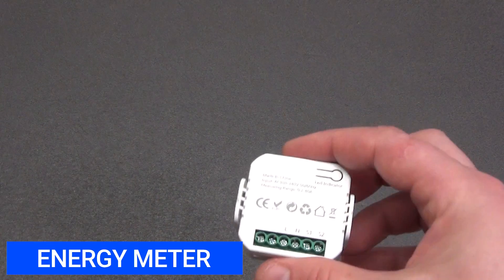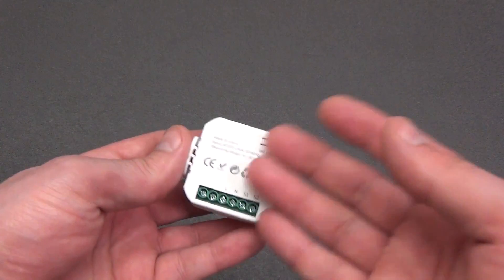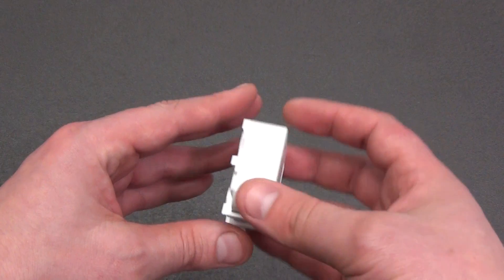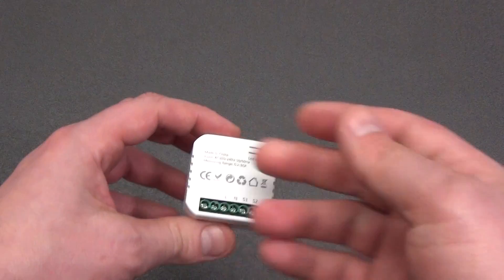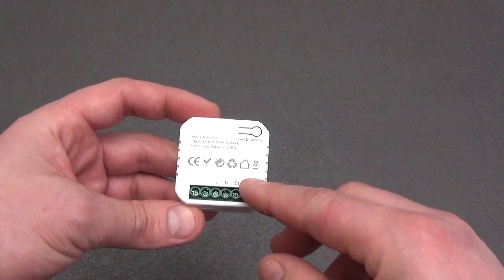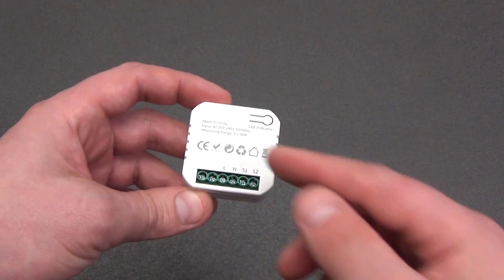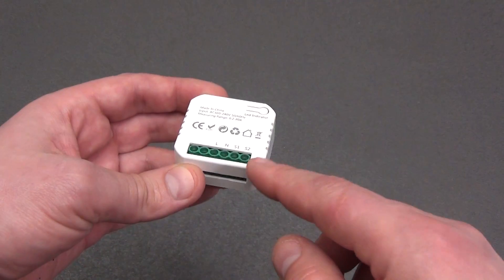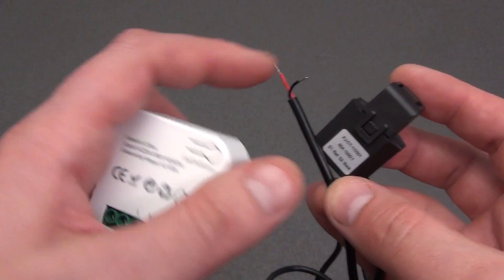The design of the device is similar to a regular smart relay in a socket box. Apparently, to save money, the manufacturer decided not to change the appearance but replaced only the filling. Thanks to the plastic latch, the energy monitor can be mounted on a DIN rail, or attached to any surface using the included adhesive tape, or even inside a socket. The dimensions are 50x46mm with a depth of 19mm. On the front there is a single button for pairing and an LED indicating connection status. L and N are the power supply terminals; S1 and S2 connect the current transformer — S1 is the red wire and S2 is the black wire.